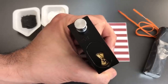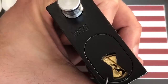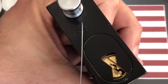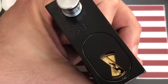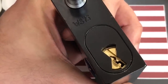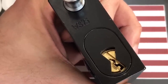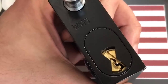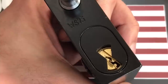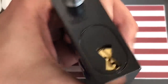The idea is that we want to blow this retainer cap right out of the lock. The only thing holding it in is a screw that comes right down here, and it's a pretty small screw. Everything around it is hardened steel — the lock body is hardened steel, the retainer plate is hardened steel. That screw is not. My hope is that the mixture will shear that screw right off, blow the retainer plate out, blow the lock core out, and allow us to open this lock.